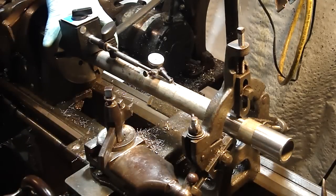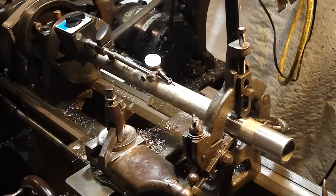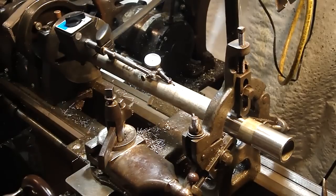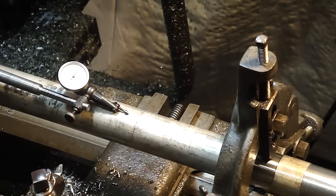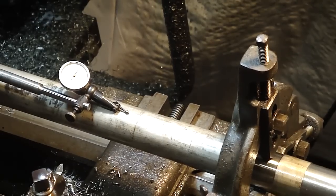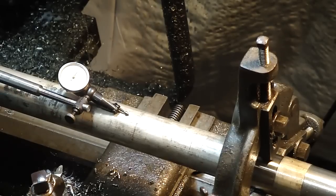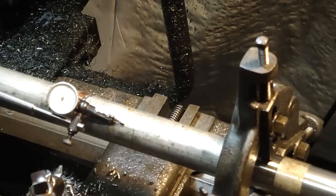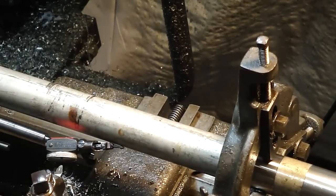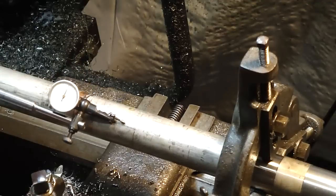Alright, so I've dialed in. It says seven thousandths on it right there — can you even read that? Let me get you set up closer where you can read this and then we'll continue. So let's hope that you can read that — you're precariously balanced on top of my stool. It clears my tool. As I rotate this around right now, none of the jaws are touching. They shouldn't be because I cut out from there. This indicator will read different.